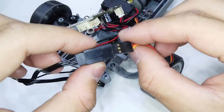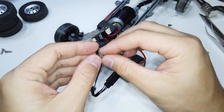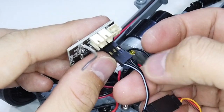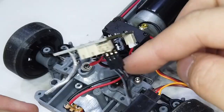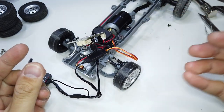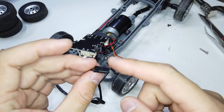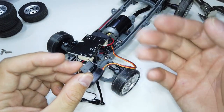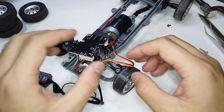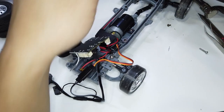Plug this into the female connector — white colour is the signal wire. On the other side, plug into the male connector on the receiver board. White wire is the signal wire, black is ground. This is the gain adjuster; we don't need it yet because there's no extra channel on this board. If you have an aftermarket receiver, you can connect it to channel 3 or channel 6 — it has a tuning knob to adjust the gain.